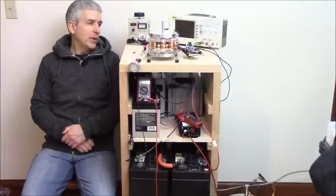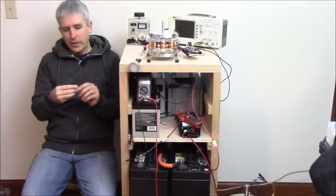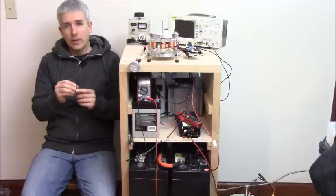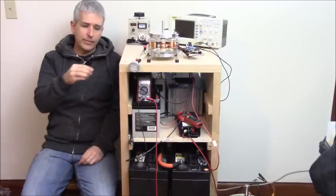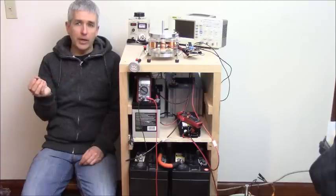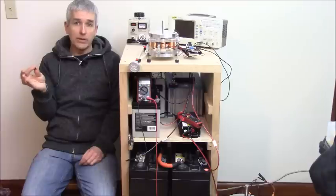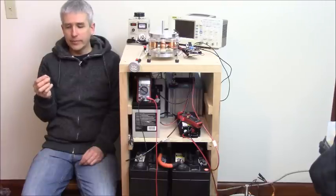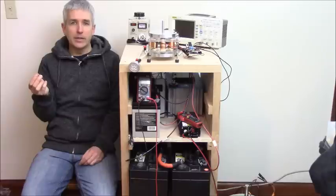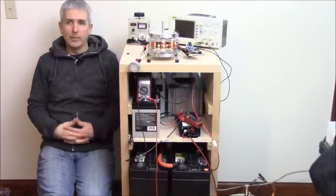What I said we're going to get to in a moment, I'll say now. Across the MOSFET, drain and source, so the center terminal and the right terminal, is where, if we were looking at a transistor, we put the neon bulb. The neon bulb was for a very low power 12 volt system to indicate, oh, your battery has been disconnected, so stop the motor and don't damage it. But this is not sufficient to protect the transistor that is pushing any more than 25 milliamps.